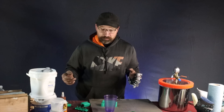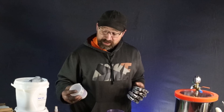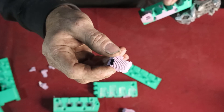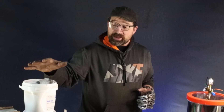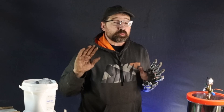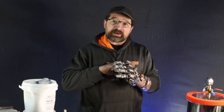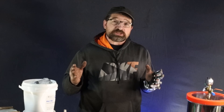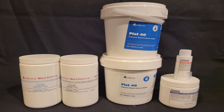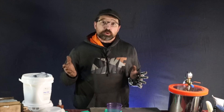Next you prepare the silicone. I've experimented with a bunch of materials to make the distals out of — anything from Alumilite mold putty to GE Silicone 2 caulking, but what I think is the best is Alumilite Silplat 25. I've had really good luck with it. They're just soft enough that they add a lot of grip, but not so soft that they're really squishy. Maybe a Shore 35 or 40 would be a better match for long wear, but then you start getting into the world of a urethane.